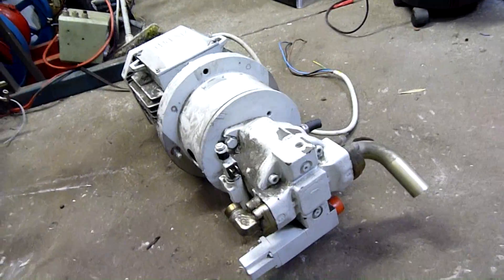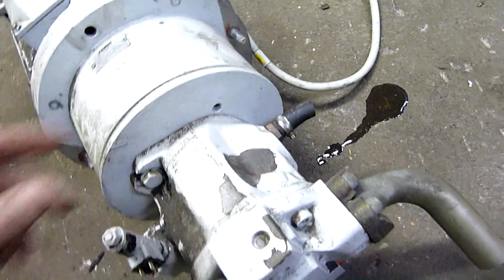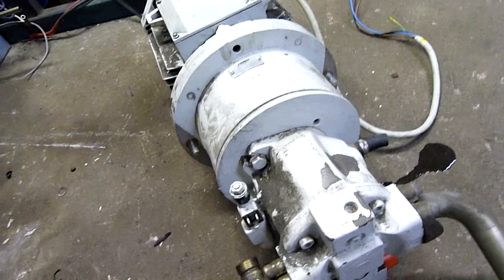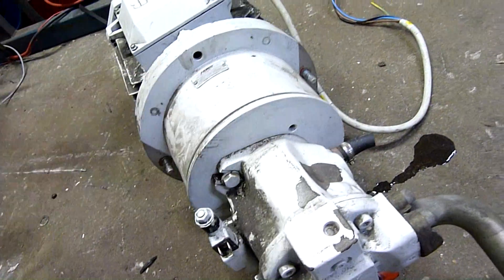That's the outlet, so it's not so bad, but I want to keep debris and dust out of the inlets and the bearing gear case. That's a spill port that goes back to tank — that's any fluid that blows past the actual pump stage, which is also used to lubricate the bearings. So the main seal on here is never really under any real pressure.